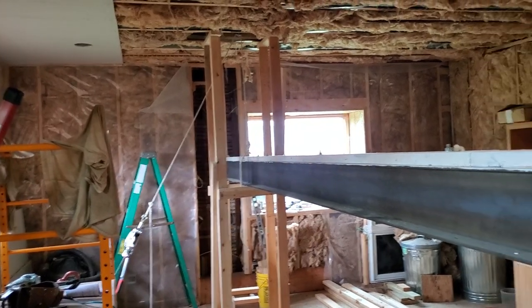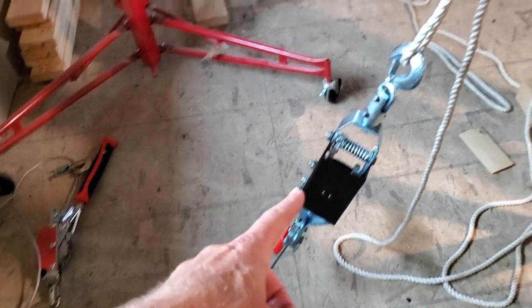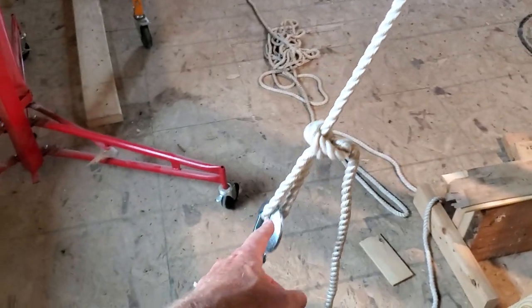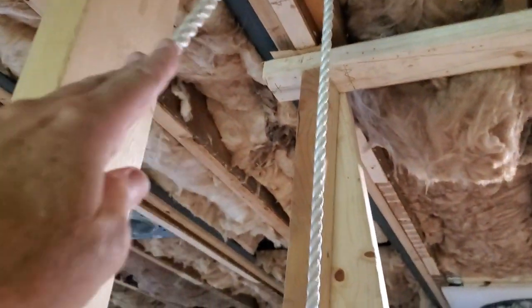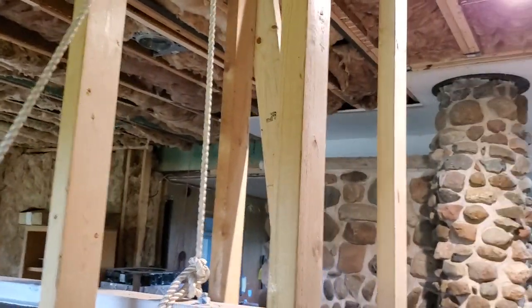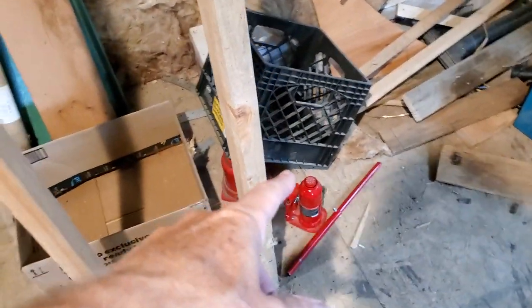I'm going to have to do it in two lifts. I built these little temporary walls on either side of the beam — two on each end — to help with the lifting. The next step is to loosen the come-along on each end, put a new alpine butterfly hitch up here, and start pulling from up there. I can raise it almost all the way — to within about two inches of the joists — nail it off so it's hanging in the air, then use built-up posts and bottle jacks to snug it into place.